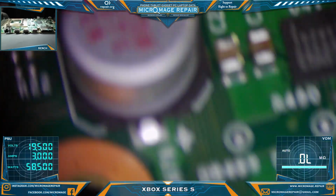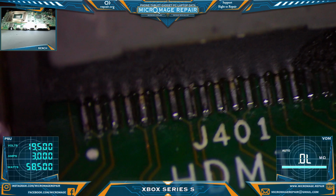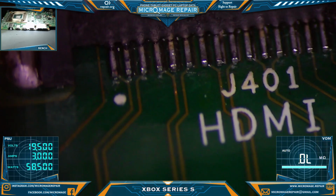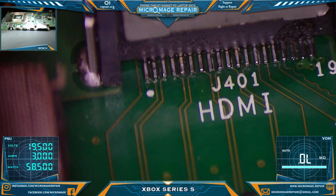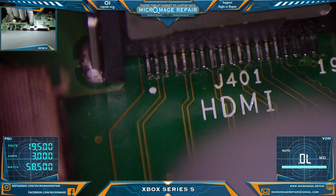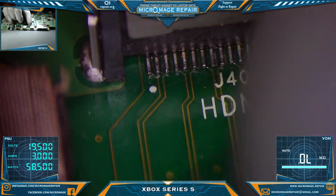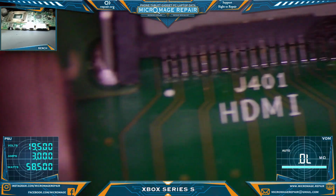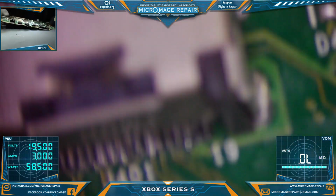Okay, let's take a final look at what our modified port ended up as. Not perfect alignment, but it's right on top of them. Each pin is secure on there. I had a little bit of singeing when I had to wick some of those bridges out. It's a little hard; the Pico pencil would normally flow those really easily, but not so much when you have no pad to make contact with, so it was a little bit difficult. We got good feed through on the anchors.